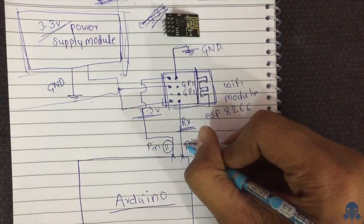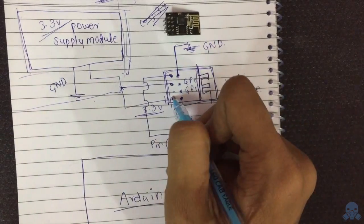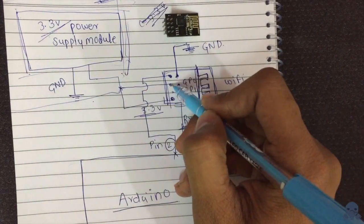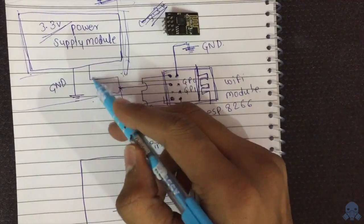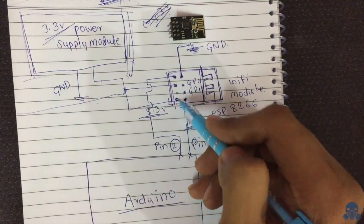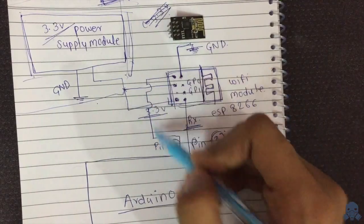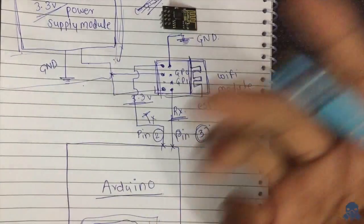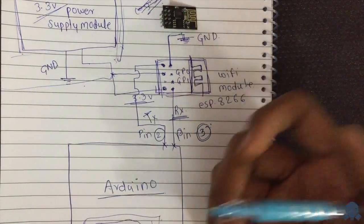This pin and these two pins require the 3.3 voltage supply, so we have connected them to the voltage supply module. The last relevant pin is the TX pin, which goes to Arduino pin number 2. The LEDs will be connected to the Arduino on whichever pins you want, but we'll cover that later.